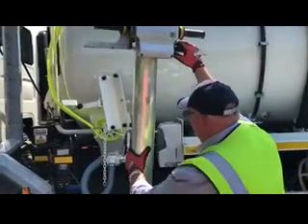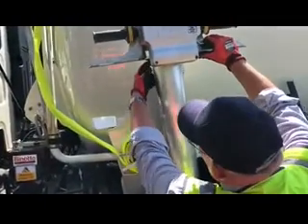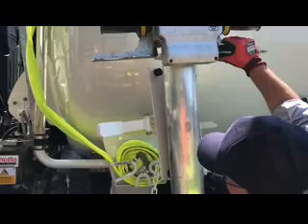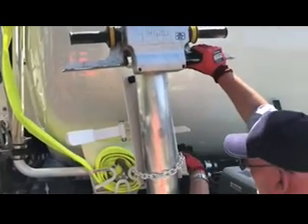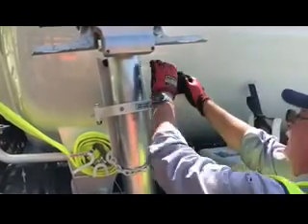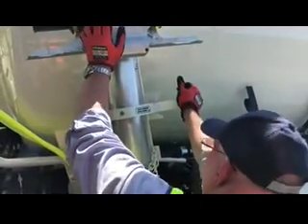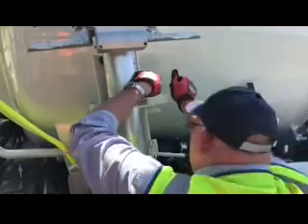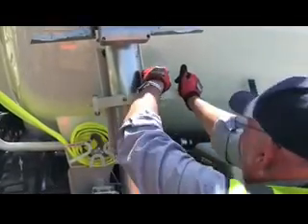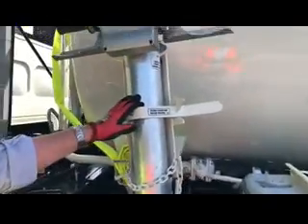To put the boom back, we're going back into the hole here, to the cradle. You want to make sure that the flange is above the top. You can put your safety chain back on and then bring your clamp round. With the clamp down, you should be able to get it in a position where it locks in. So that's the boom clamp back up again.